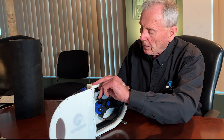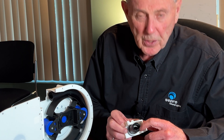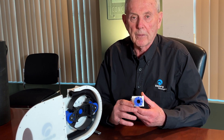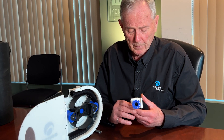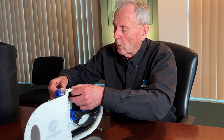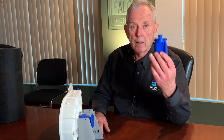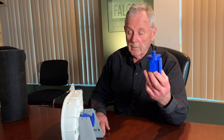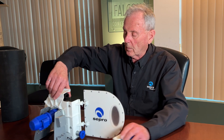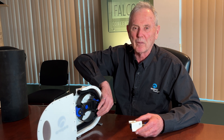You can see that the hose itself has an elliptical interior cross-section and a circular outer cross-section. It has a transition to round as we go out, so it takes conventional pipe fittings to be fitted to a system. The power required to run this pump — the electric motor — can be considerably smaller, probably one third less than you are experiencing with your conventional pump. We have also developed a very simple, easy means of changing the hose on this pump, which will be the subject of an upcoming video.